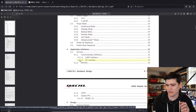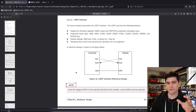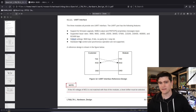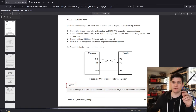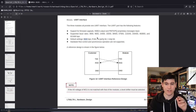The datasheet documents the output data in the application interfaces section under UART interfaces and communication interfaces. It gives us really useful information for decoding the data. It tells us the supported baud rates and the default settings. Nine times out of ten, the manufacturer won't reconfigure these, so we'll use the defaults: 9600 baud, 8 data bits, no parity bit, and 1 stop bit.